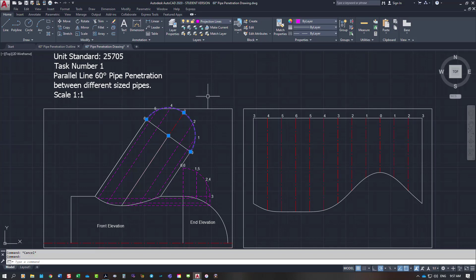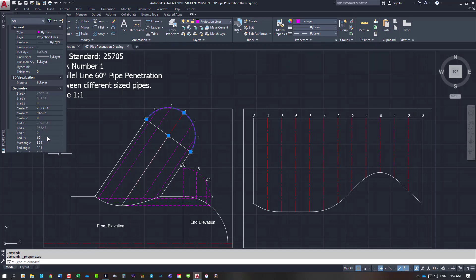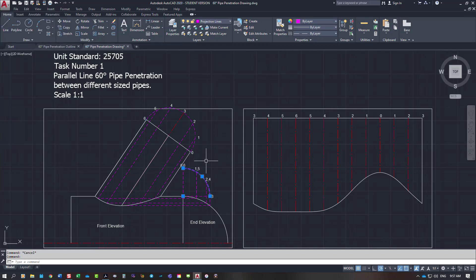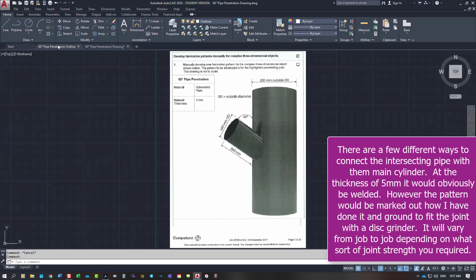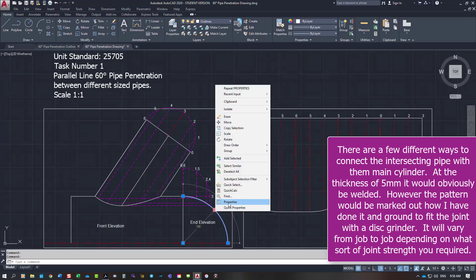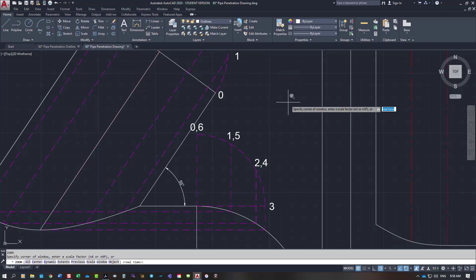The circle here is at 60 millimeters radius — you would use half of 95, which is 47.5 millimeters — that would be your circle across there and the same for that radius at 47.5. Your large pipe was 200 millimeters OD, and you're developing the pipe to sit on the top of it, so you only work to the mean line across the end. Draw them on two sheets of paper at a scale of one to one. My angle in this drawing was 55 degrees — yours needs to be 60. That's a pipe junction pattern development.